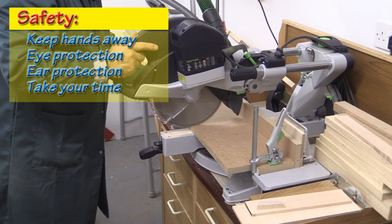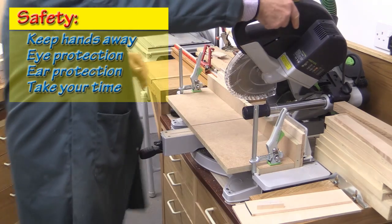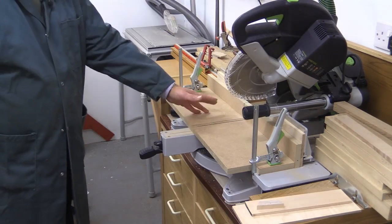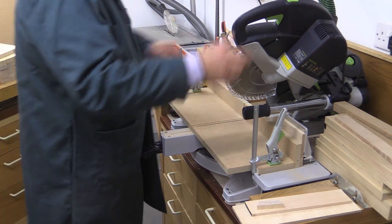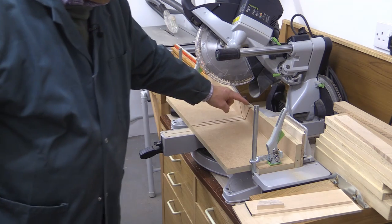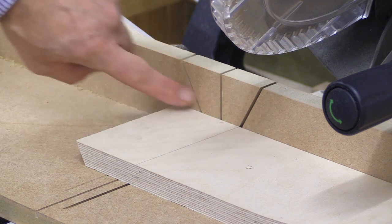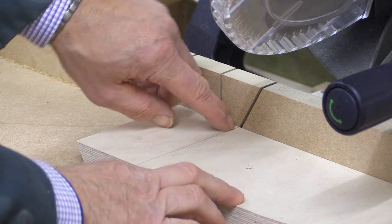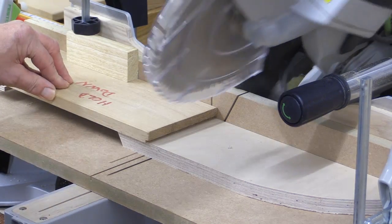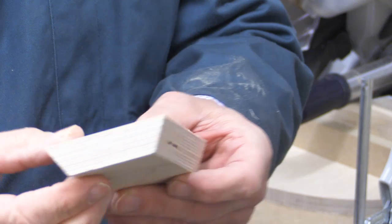And when I do a cut now, there's a straight cut. And if I go over to 30 degrees, that's 30 degrees. And you can see now I've got zero clearance, 30 degrees that way and indeed this way too. Now, the only thing you have to watch is these pieces are not terribly well held on because they've just got that slender bit of glue at the bottom. The advantage now is with these kerf marks at the back here, I can line up where I want to do my cut exactly in the right place. I've held this in place because I don't want to get my fingers anywhere near this as it does the cut. And there's that piece cut to shape.